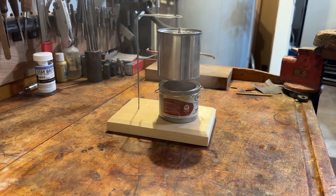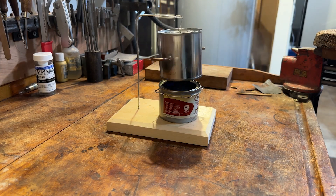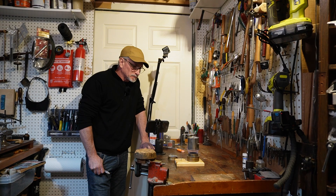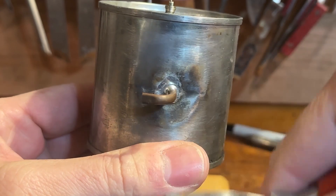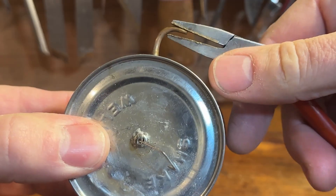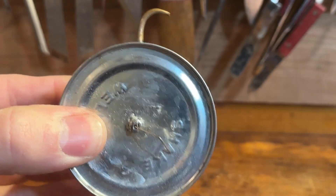I'm going to summarize several days worth of troubleshooting. Sterno isn't really made for boiling — it's not hot enough to generate enough steam to make this engine turn. Here we see the very same setup working fine with the assistance of a butane torch. Tip one: use an alcohol stove. Tip two: make sure the nozzle jets are parallel to the ground. Tip three: pinch the nozzle openings down a little bit. Tip four: bend the nozzles in toward the can so that the angle is a bit less than 90 degrees.